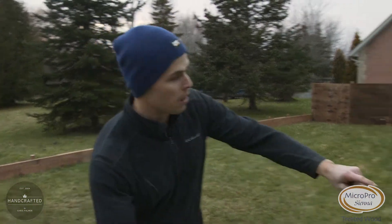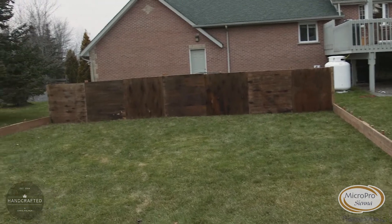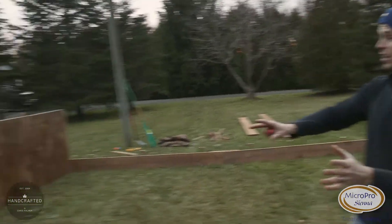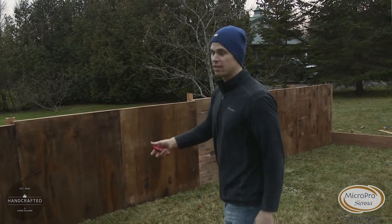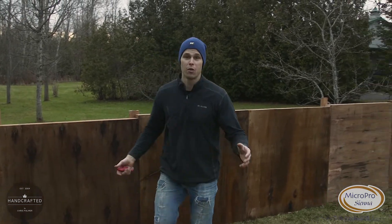It's been a long afternoon but folks, the epic rink is built. We've got our frame with 2x10 skirting going all the way down the boards, our 4x4 posts in the corners ready to take on some action. Over here on the ends, we've built up beautiful 3/4-inch plywood frame boxes, each one reinforced with a 2x4 and each one with its own spine brace staked into the ground, giving it rock-solid ability to take those hits when play gets rough.